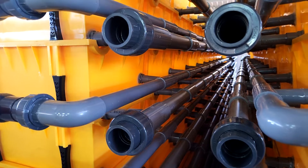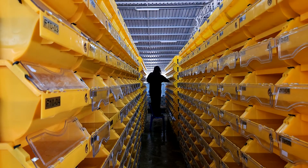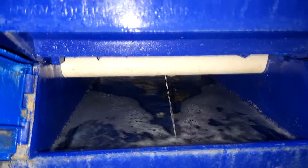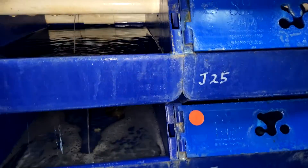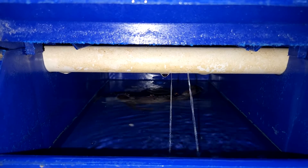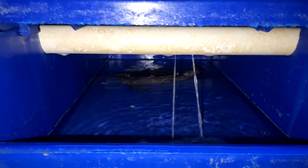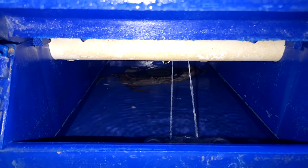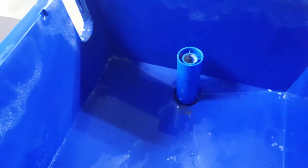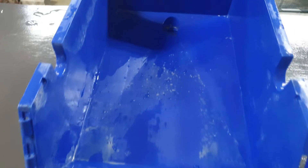You can't just do that with any other boxes because most of them are mounted in between. This is a very important consideration, and it was not previously available with some boxes — for example in my own farm, the inlets are fixed, and over time we know from experience that they will clog up. You have to drill multiple holes on the boxes to ensure that flow is distributed properly, because over time it tends to plug up with fouling, which is hard to manage. For the outlet, you can't really change it either — the flow is very weak because it's all predetermined, meaning you can't change the outlet size or the underlying piping.